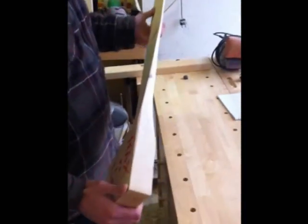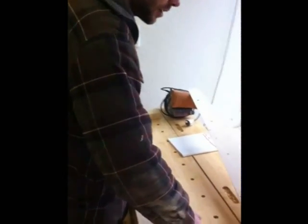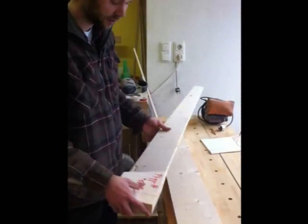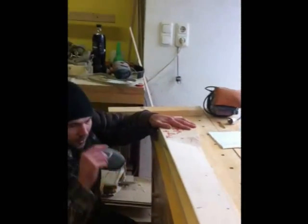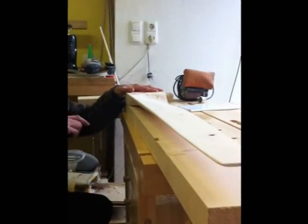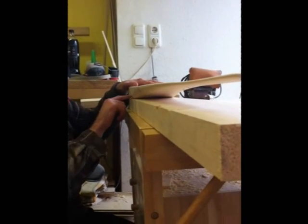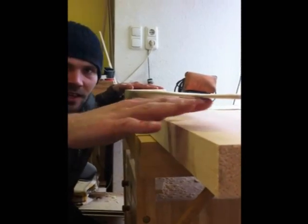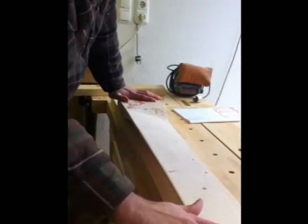So the basic difference is that Hugh Piggott in his book approaches the blade shape by cutting from two sides. If you have a look from the bottom, the lead side of the blade has an angle. So from root to tip you have to take off material on the lee side and also here on the windward side to get the angles right.